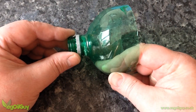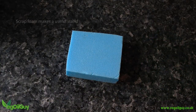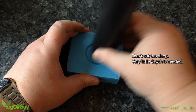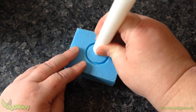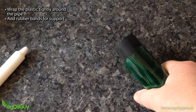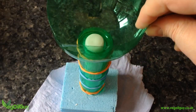The plastic bottle needs to be cut to be roughly the same length as the candle. The top of the bottle makes a useful funnel, especially if you cut the screw section off using an ordinary hacksaw. This is extruded foam, but ordinary white expanded foam works as well. The pipe is firmly pushed into this and it carves out a nice circular hole. This tapered end of the candle makes it easier to push the candle centrally into the foam. The plastic is wrapped tightly around the pipe and held in place with some rubber bands. Once slid from the pipe, this sits nicely in the foam and the candle is pushed into its hole.